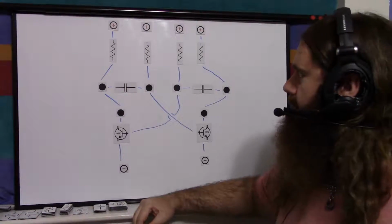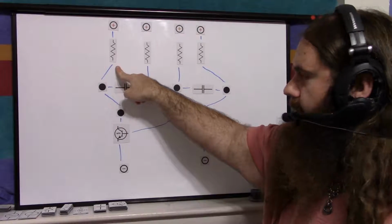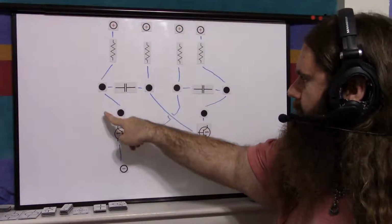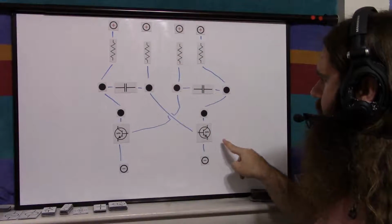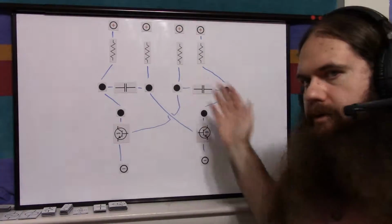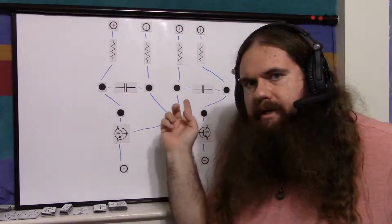No surprises here. We have our load resistors driving what would be the load here, such as an LED usually, through the charging end of the capacitor, through the transistor, and the other side of the capacitors cross-connected with the bases of the NPN transistors to do the oscillation with feedback throughout the circuit. There we go. But the load isn't in here.